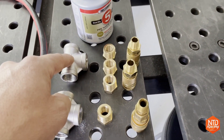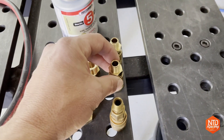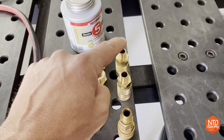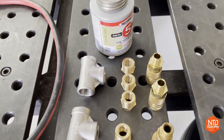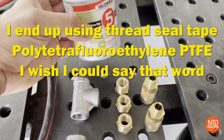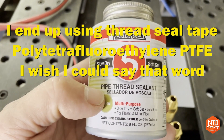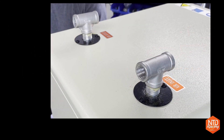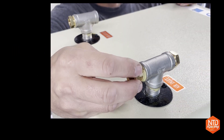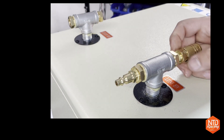On the outlet side, again, two reducers going down to quarter-inch NPT, and then two quick disconnects: one will go to my plasma cutter, and one will be open for other tools. I don't use a compressor very often — I usually use DeWalt 20-volt for most of my tools. To seal the threads, my plan was to use pipe thread sealant by Rector Seal, but it ended up being a mess — kind of like Gorilla Glue, getting on your hands and staining everything. So I ended up just using Teflon tape, and it held all the air perfectly. I just recommend regular old Teflon tape.